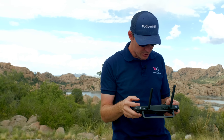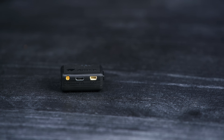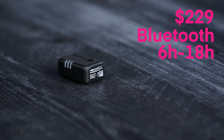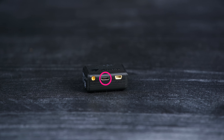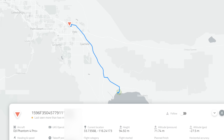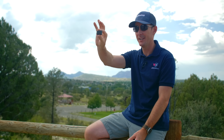The DroneTag Beacon is smaller and cheaper than the Mini, cutting out many features the average pilot won't use. It's still pretty expensive at $229. It uses Bluetooth, runs 6 to 18 hours, and weighs 16 grams. Like the Mini, it has a flight controller extension port and Bluetooth antenna extension, and charges via micro USB. A long press turns it on or off; a short press activates the tracking function. In testing, we were really surprised — the furthest range was only 341 feet using the DroneScanner app.